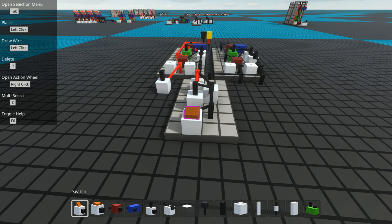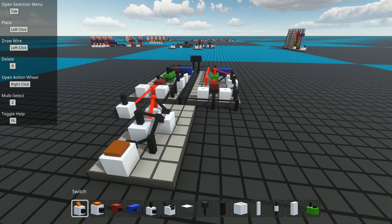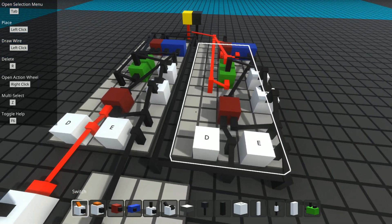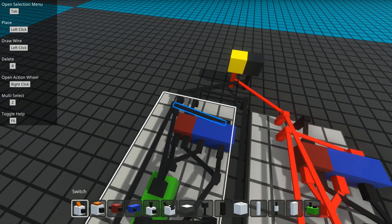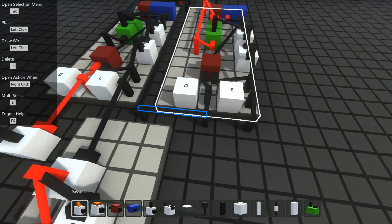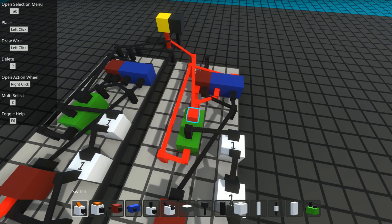My one-bit adder is now at one. When I add again it should go to zero and you should see a carry bit blip down this line. To make a two-bit binary adder I just copy the circuit exactly — except rather than feeding it with a constant one value like the left circuit, I send the result of the carry from this board down the wire. When I get a carry — one plus one equals ten in binary — it sends that carry signal into this second adder, which adds that carry to the current D-latch value of that circuit.